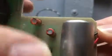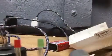So carbon monoxide detection is a, if I remember correctly, I think this is a catalytic detector, and so you're looking at the amount of conductivity that you get out of this when you have carbon monoxide going into it. Problem is that water screws with that in a big way, and so you need to have some sort of desiccant on the front side. So let's see if we can open that up a little bit.